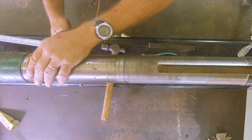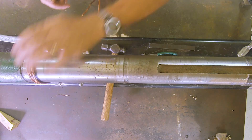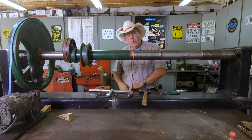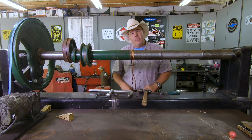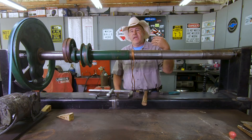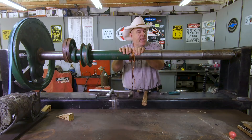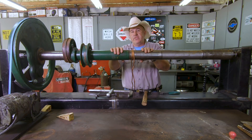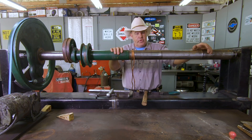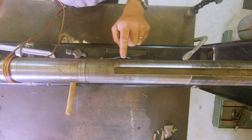I've wrapped the copper braid around the shaft a couple of times; it comes down here to the table and clamps down, and both the table and the clamp are ground. Think of it like a commutator on an electric motor — it gives us a continuous amount of current as the shaft turns with little or no arcing, because we don't want to damage the shaft in any way. We also have a keyway here, and a keyway will be a start and stop for an arc — we don't want that.